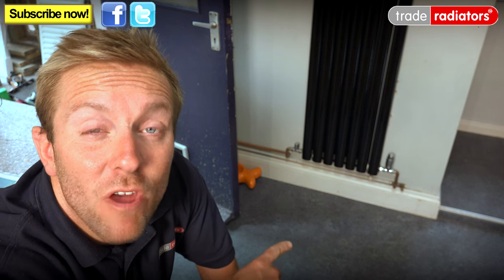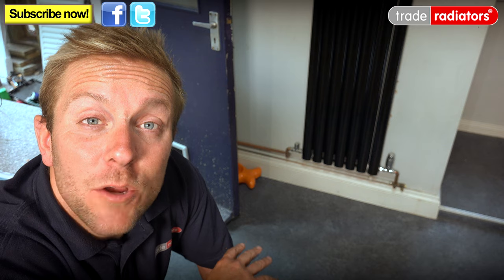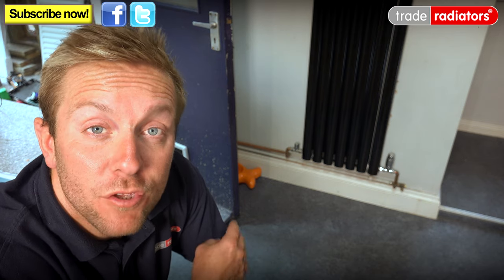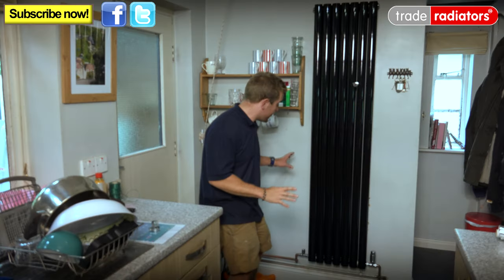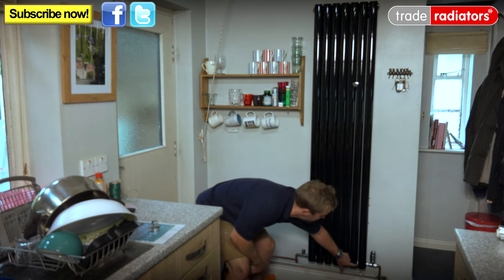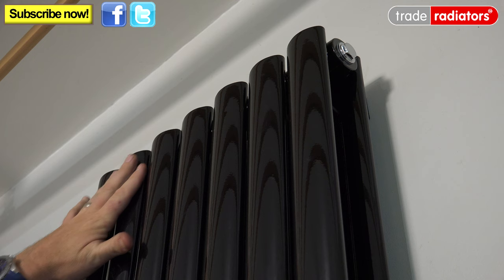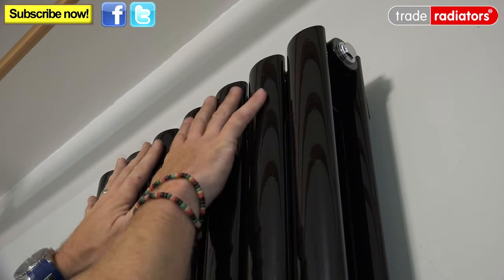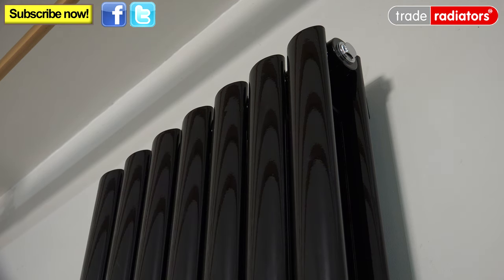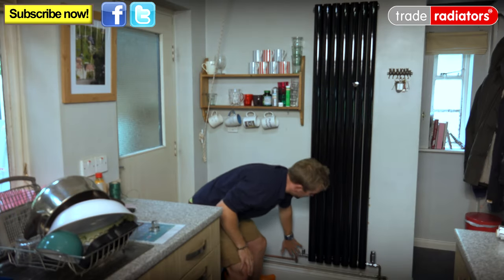The hot water can come in straight away, go up the first bar of the radiator to the top, and then cascade down equally along all the other fins going off to the return. So looking at this radiator here, the water will come into the bottom just here, and we've got our little flap just inside this bottom pipe right here, that will force our hot water to go all the way up this first vein. Then all these other veins are connected at the top, which means hot water can then cascade down nice and equally, heating up all these fins as you go along.